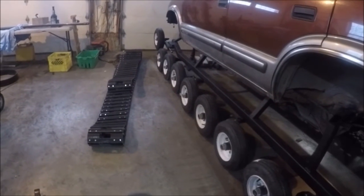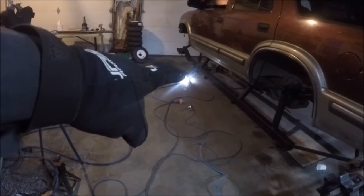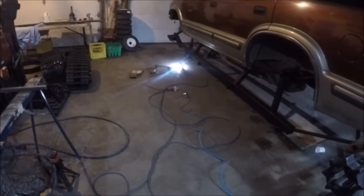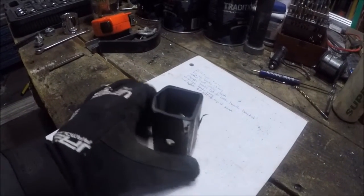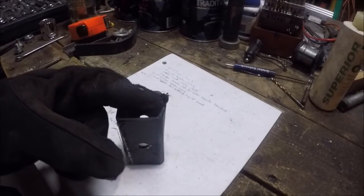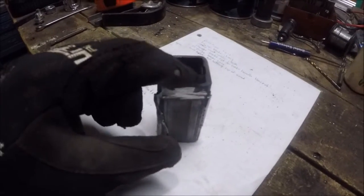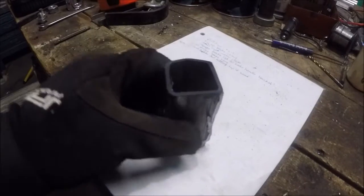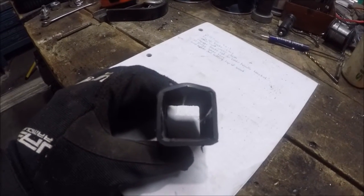Okay so I'm taking off the brackets — just got the first one off, got the grinder out. I thought I'd give you a little update on what happened to them. You can see it's pretty warped, pretty crooked. The round bar inside is pushing in one spot — the bottom there — and on this side the top is backed up closely by the weld. On the back side it was pushing on the bottom with nothing to hold it — big deformation.